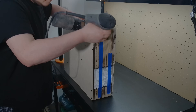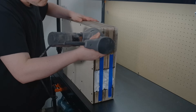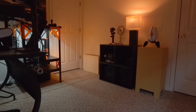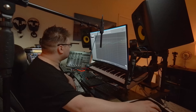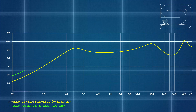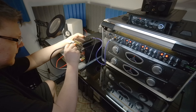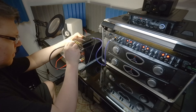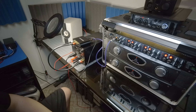At any rate, once the two remaining layers have been sanded down, the enclosure is essentially ready to be tested. So here I've stuck it in the corner of my office, which is about as small a room as I have on hand for this, and after all the effort, I am relieved to see it perform as expected — certainly along the bass and sub-bass region, with a shallow dip between the two. Above the lows, however, is that distinct, unequivocal bass horn presence that ultimately defines the listening experience, and I'm wondering if any of it could be relayed over YouTube.